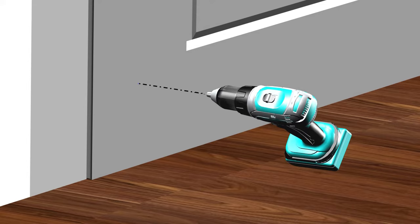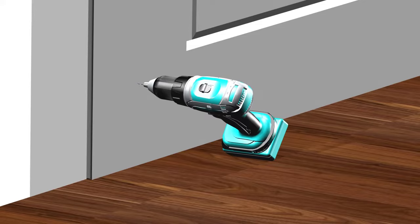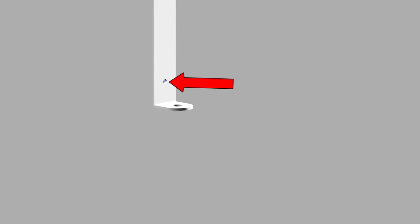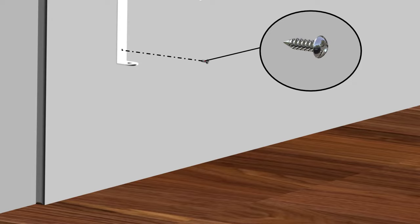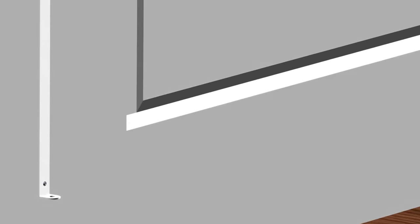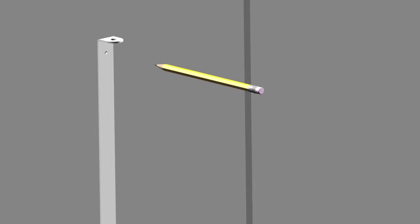Next, using a drill with a 1/8 inch diameter drill bit, drill a small pilot hole. Proceed by placing the hinge bracket, Part A, vertically up against the wall. Make sure the bottom hole on the bracket matches the drilled hole location. The bracket must be flat and perpendicular to the ground. Insert Phillips screw Part C in the bottom drilled hole if you are installing the gate in wood. If you are installing in drywall, Part J long screws may be used to attach the gate through drywall and into the stud. Based on your installation, special anchors for the wall might be needed. Tighten the screw using the screwdriver. Careful not to over-tighten the screw. Use a pencil to mark the location of the top hole.